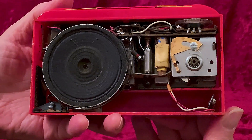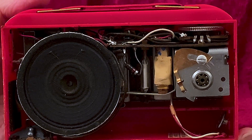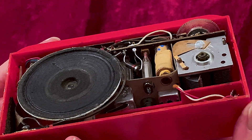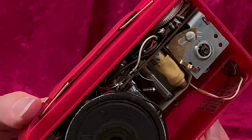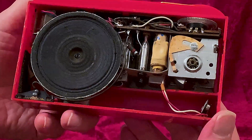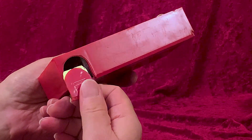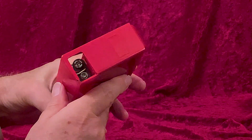You can see a couple of the little flat sub-miniature tubes in here. There are four altogether powering this radio, and the tubes are branded Emerson. This radio has two battery covers because it takes two different batteries. Those unfamiliar with tube technology in the pre-transistor era may be interested to learn that the tubes themselves needed their own power source just to light them up, like the tiny dim light bulbs that they kind of are. That power supply for the tube filaments is separate from the main power supply that makes all the rest of the radio work. In this radio, the filaments are lit by a 1.5-volt battery which loads through the bottom battery cover.